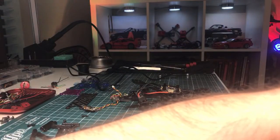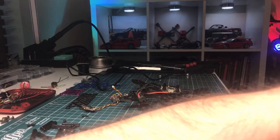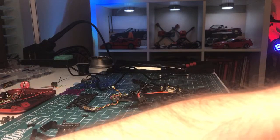I don't personally like 1408s. I think that is too much stator height and not enough stator width. But for a racer, that's what they want. So that's what most of the motors are kind of going towards for micros. Noah brings up a really great point right after yours about how notchy they are. Those racing-oriented motors are going to tend to be really notchy, and that does not work right for freestyle builds because it creates too many vibrations.